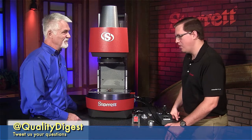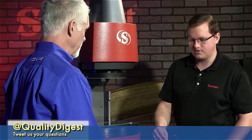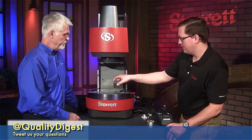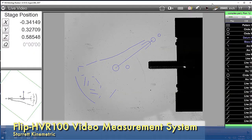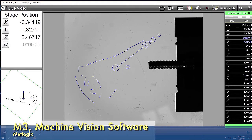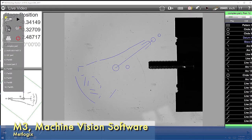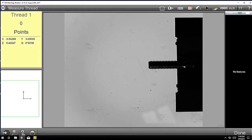That's pretty cool. So you can put hundreds of parts in the library and have them all measure this way. Very, very efficient. Another thing I'd like to show you is basically its ability with round parts, because the ones I've showed you have straight walls and straight edges. So here is an example of a round part. This is actually using a brand new module that our software guys at Metalogix just released — a thread module. And what this allows the program to do is basically tell you a bunch of information about the thread very quickly. So you use your thread tool here, and it's as simple as clicking and dragging over the thread.